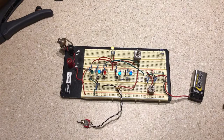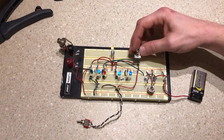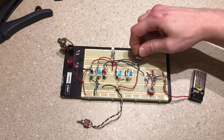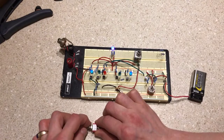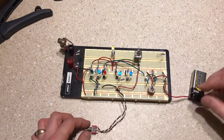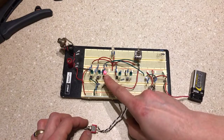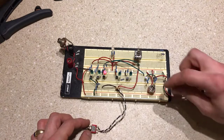I've done a mock-up of the switching circuit here on the breadboard just to make sure that everything works the way it should and all these various switches play together nicely. Here's our channel switch — this is going to be switching between the rhythm, which is yellow, and lead, which is blue. This switch is going to be our boost function — here's the boost on and off on our lead channel, and the same thing on our rhythm channel. And then this is our bypass switch right here. This red light is just representative of the portion of the circuit that will be grounded out when we're bypassing this pedal.